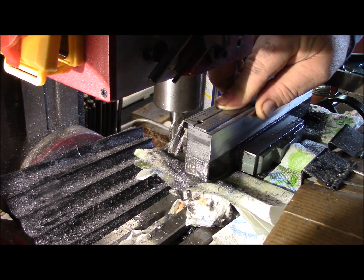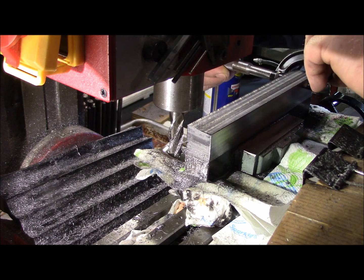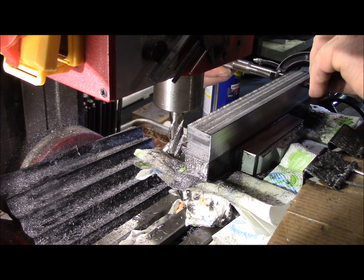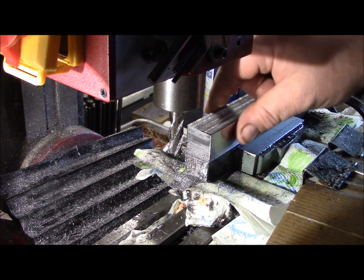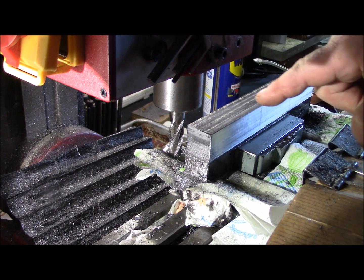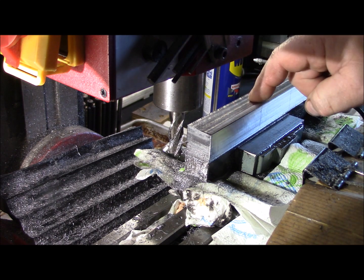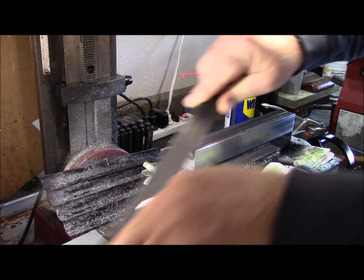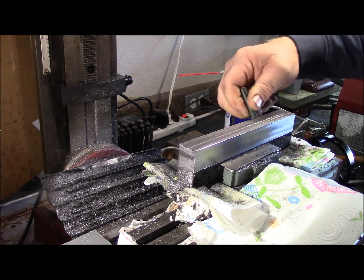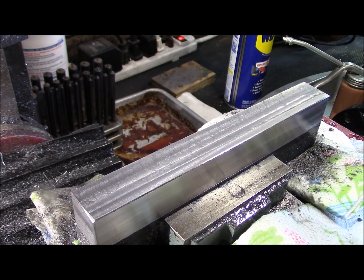With the sanding I'll have to do to that, it'll be fine. I got .973 there and .973 there, so I didn't get a full inch — I had to clean it up a little, get that scale off. I'm going to sand this anyway so I'll get it as close as I can. Now I need to drill three holes in there. I've decided to make this adaptable for a short action as well, so I'll put my tang hole right here and then the other two for short and long action over in this area.